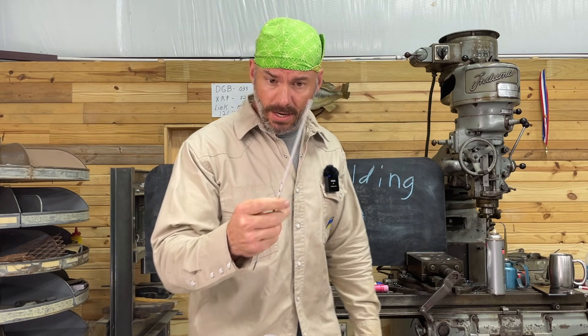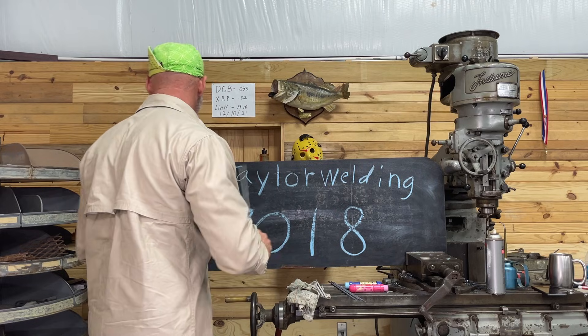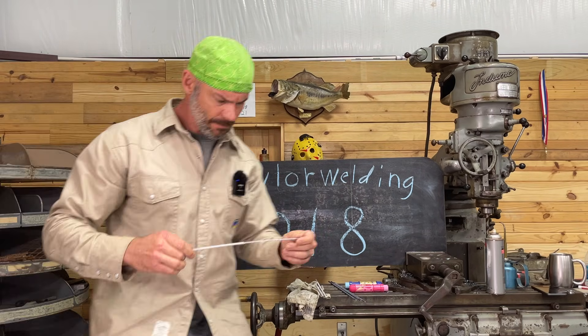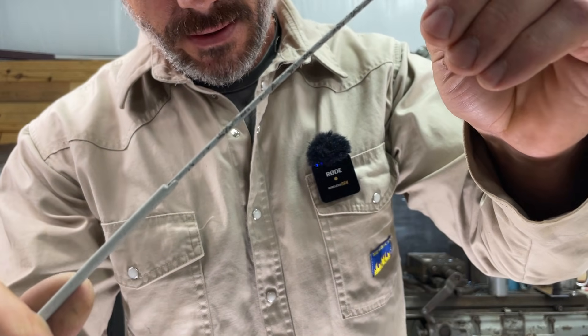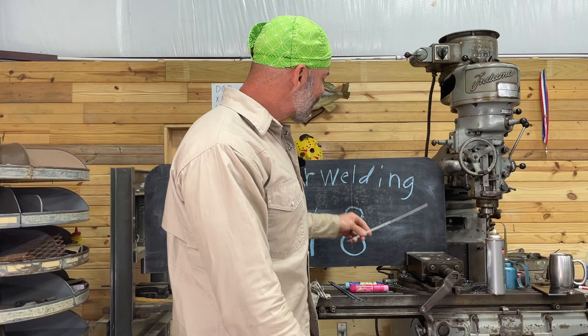A rod heater. Now every little welding inspector is going to tell you these have to be 300 degrees or you got to throw them away or put them back in the oven. Don't listen to that. I have welded so much pipe — I've welded more pipe than most people have walked by — with old welding rods. I guarantee you this rod has got rust in it right now. I use them every day. You see that rust? Little brown specks. They all have it in them, especially the old ones. And they burn fine. A 7018, I think, will last forever. I've never had a bad one.